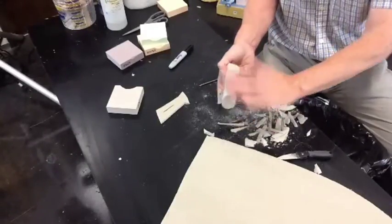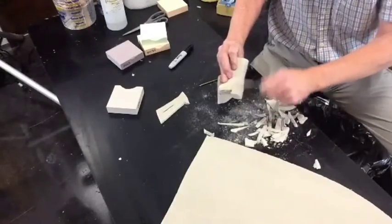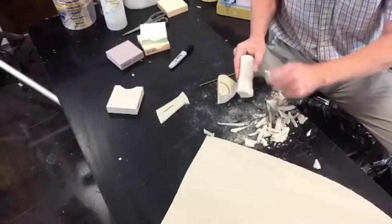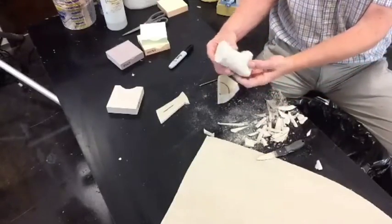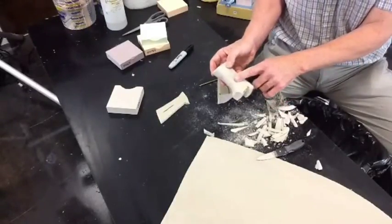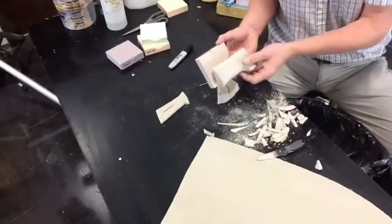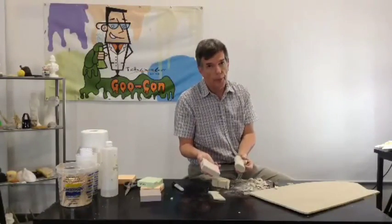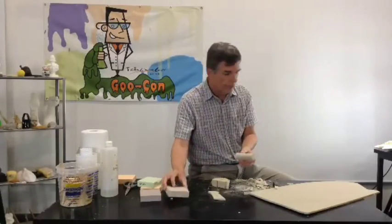All right, now, this stuff being rather porous, you do have to take some time to close it up before you can do anything like make a mold off of it, or if you want to paint it or whatever. You need to try to seal this, or just basically close up the pores in this thing so that it would accept paint and it wouldn't look all grainy. That's the big difference again. The more dense the product, the less grainy it's going to look, but the more dense the product, the longer it's going to take for you to do this. So trade-off is what it is.